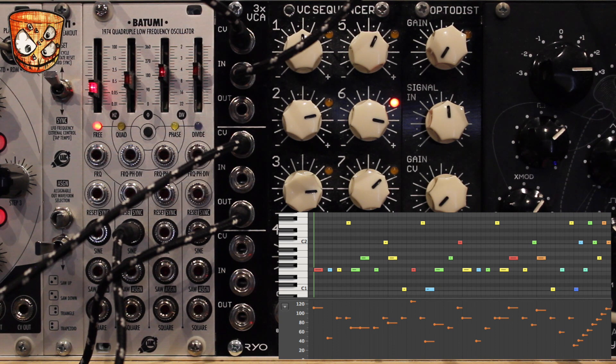This gives us a more dynamic pattern with just the one sequence playing, with the first VCA being opened by the envelope and then the velocity moving the level of the second VCA's output. Without velocity, this would just be static and all at one level from the envelope triggering the first VCA.